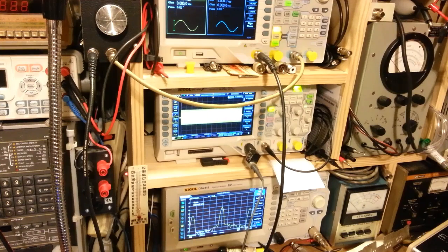Basically, any audio signal you put into this thing, it's going to transmit. And it doesn't care how far outside of human hearing it is. It's going to transmit. Because when you get out here to the far right or left-hand side of the edge on the screen of this spectrum analyzer, that's 25,000 hertz away from the carrier.